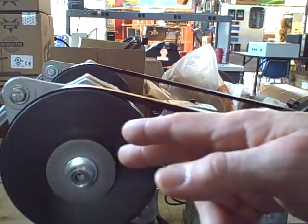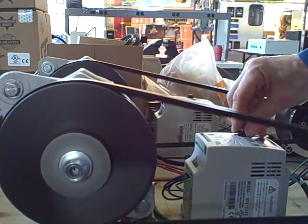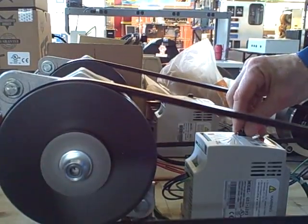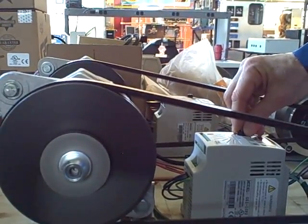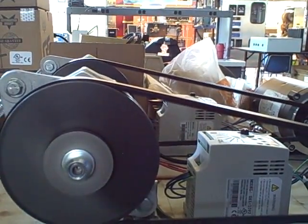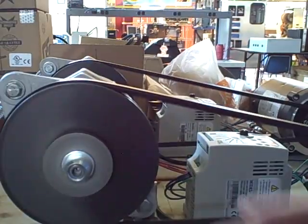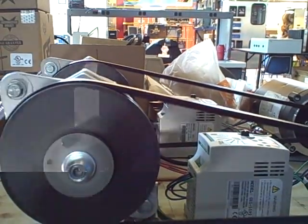I'm now going to slow down the driver for the foreground generator back to 60 hertz — they should now fall perfectly in sync. Counting down: 60.5, 60.4, 60.3, 60.0. Now we should see those two pieces of tape in much closer alignment than before, showing that these two generators are no longer laboring against each other, but are truly and equitably in sync.